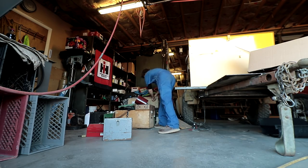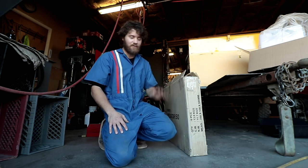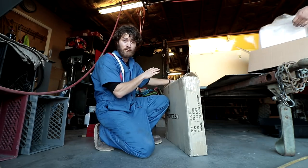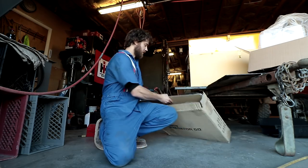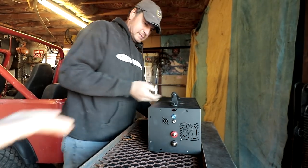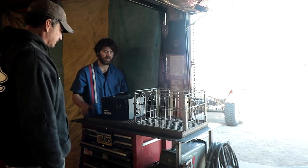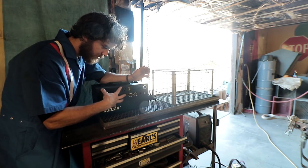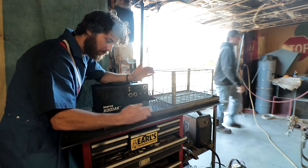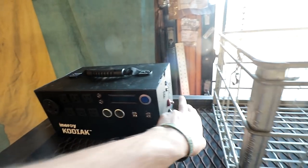They also make 100 watt or 50 watt solar panels. In the past 10 years, solar power energy has made leaps and bounds as far as technology goes. So I decided to replace those almost 10-year-old 40 watt panels with four 50 watt solar panels. They have rails on the side so you can connect them right up next to each other. We've got to figure out a layout for how we want to mount this — try to utilize the entire platform for space. By allowing this much space in front of the solar power generator, I'm going to be able to run wires without hitting anything.